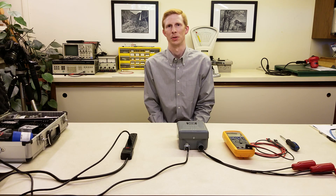In general, 1500 relays are very reliable, but they've been around since the 1980s, so there's been plenty of time for systems with these relays to develop problems. When level control systems with 1500s fail, by far the most common cause is the electrode circuit, and operating with a faulty electrode circuit can cause premature wear and ultimately failure of the relay.